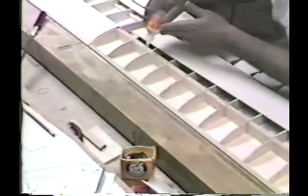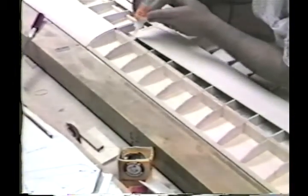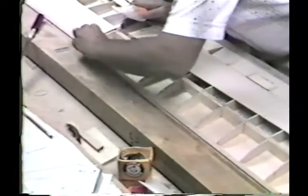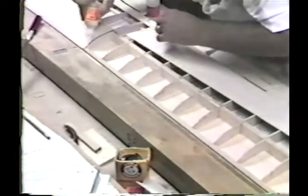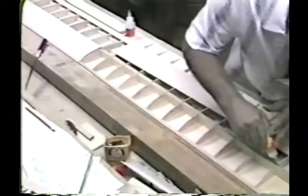That's why Arm & Hammer baking soda comes in real handy if you're working in a cold climate, because it kicks it on command. There are 12 ribs in this section, and it takes quite a while to put the Super T on each rib and the spar and so forth, but Super T gives you that time. It just sits there and waits for the planking — doesn't soak in. It's got body and it just stays on top of the ribs until you're ready to go.